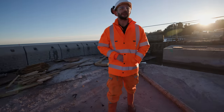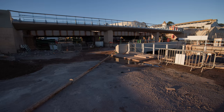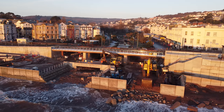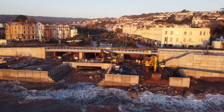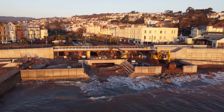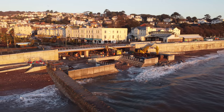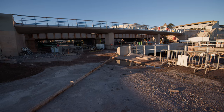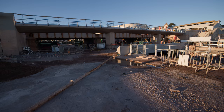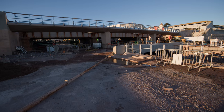As you walk over into the corner you get a view of all three spans now with all the false work stripped out — that's amazing. The fence running along the top of the link bridge on both sides has got a temporary blue ratchet strap at the minute. That gets removed and then every 100mm up the post there's a wire strand to run through. We can't order the wire strand until all the fencing is installed, because we need to measure the exact length — if it's too slack or not long enough it won't work. We install everything, run a string line through, and measure the length. Stone will have ordered the wires and they should be here within the next two weeks, then the blue ratchet strap comes down and the permanent system goes in.